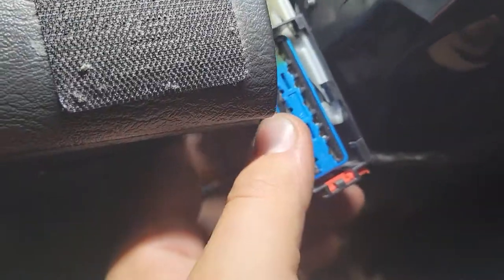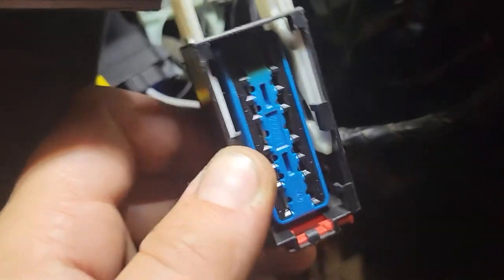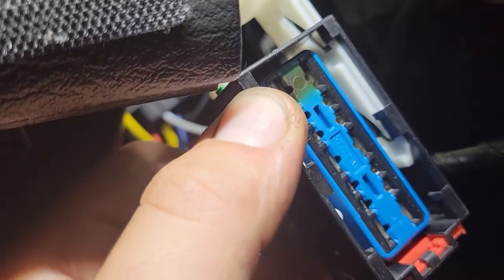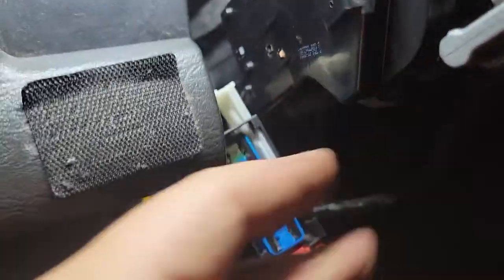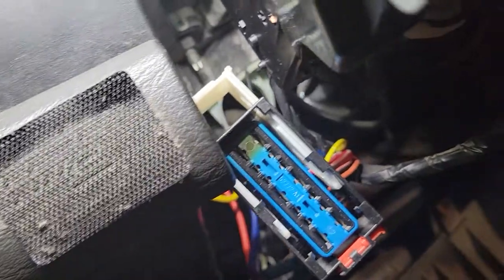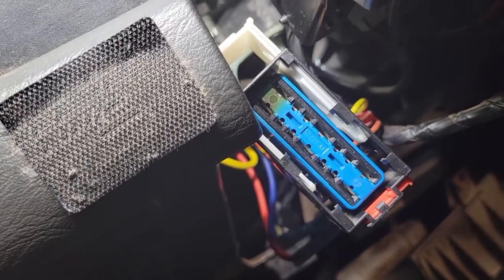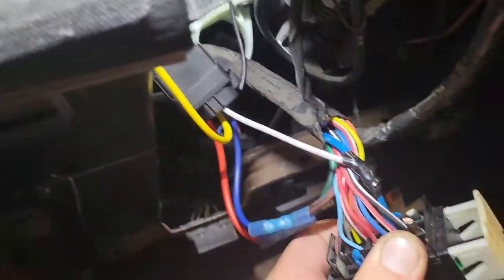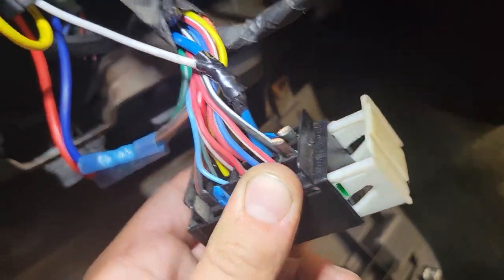I'll show you 100% confirmation that it's our issue. That clips out like that — it's about three-quarters of an inch up and just pops out. If you pull out your switch plug and those top two wires are burnt like that, you can throw switches on it until the cows come home — you're going to have issues because you're building extra resistance at that point.